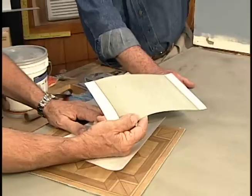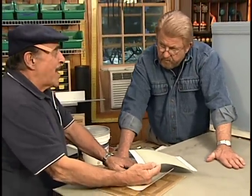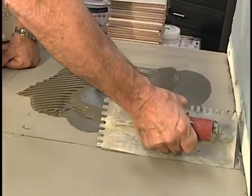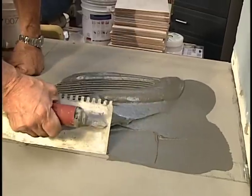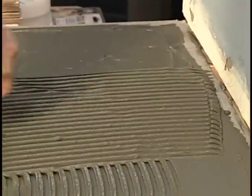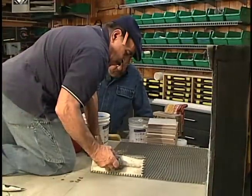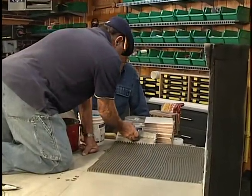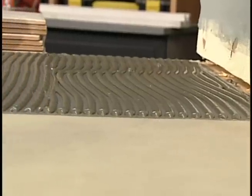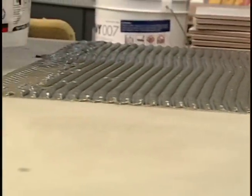It's probably less than a 32nd of an inch, so we didn't raise the floor, use any nails or screws, or add any weight. A second, heavier coat of thin-set will be applied on top of the first. Armin uses the smooth edge of the trowel to spread the cement, then changes to the notch side and, holding the tool at a steep angle, creates parallel ridges that are all the same height. This ensures an even coating beneath each tile and no low spots or voids that might cause tiles to break or crack later on.